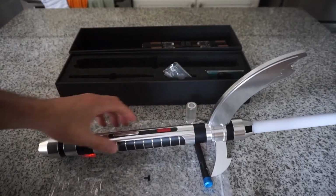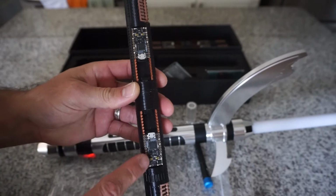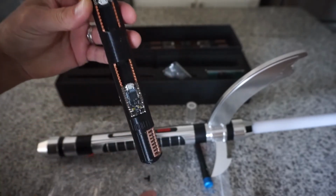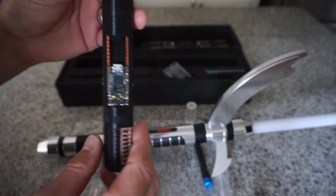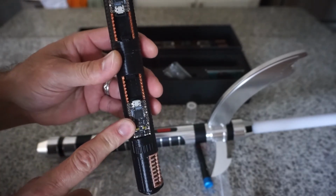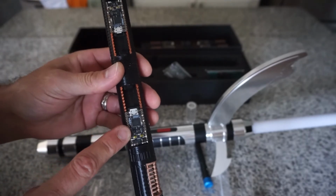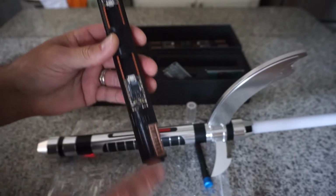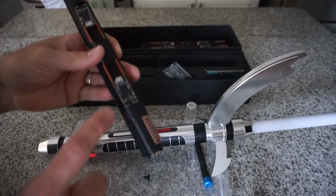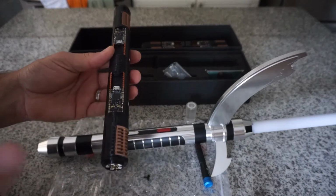The reason the config files are different is because of the Proffie orientation. By default, the orientation is USB facing the pommel, and that's good for the top. But if you notice on the bottom, the USB and the SD card is facing the emitter. There's a configuration to make that work properly. If the config was not defined properly and the USB is facing up, but Proffie thinks it's facing down, then drag won't work properly, right? You'd have to be upside down to get a drag. So orientation, that's why there's two configs. Everything else about the configs is the same, except the USB orientation. So make note of that.